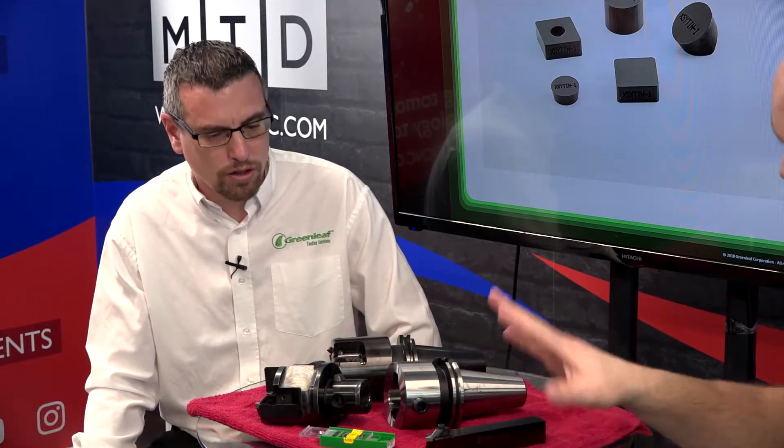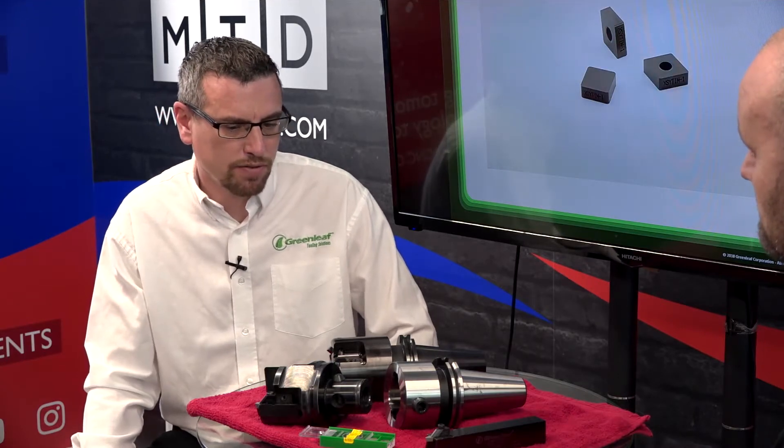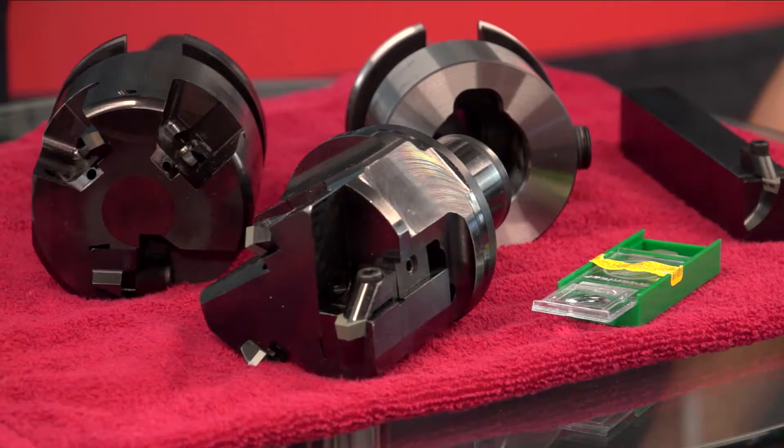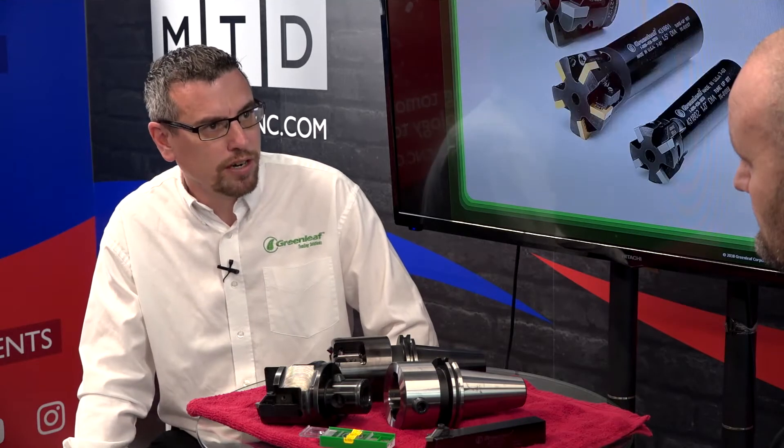All in the same tools? Yes, all in the same tools. The tools are designed as a 1-8 tool, so spindle mounted. Historically the customer had to put up facing heads to machine the tools. Being spindle mounted, it's a quick load tool, and they also machine the inboard and outboard chamfers at the same time.